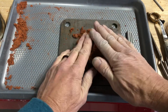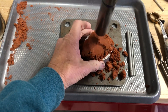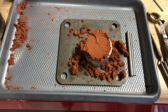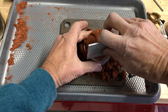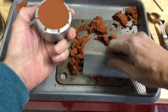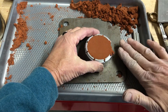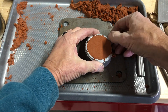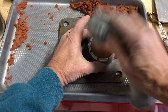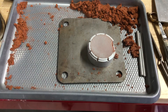If you want, you can hammer it — I use something like the end of a mandrel. Not too hard. Then you want to take something like this and scrape it off. What you want is for this to be flat, so that when you turn it over and set it down, it's flat and not going to compress downward because there's nowhere for it to go. I've also switched to cornstarch — you still shouldn't really breathe it in, but it's a lot better than talc.